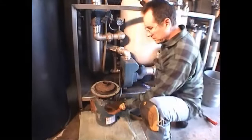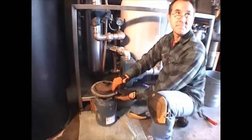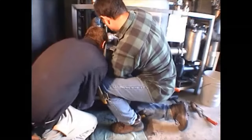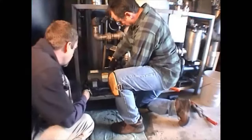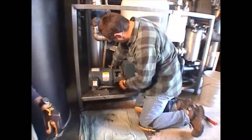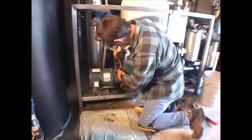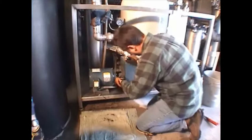Now you're ready to bolt the motor back onto the volute. I like to use a starter bolt with a little bit of anti-seize. It's good to have a friend because these pumps are kind of heavy. Put the pump and motor back onto the standoffs, line everything up, and carefully slide the impeller back into the wear ring — make sure your bolt holes line up. When putting the bolts in, clean each bolt, add a little anti-seize, and tighten in an opposite pattern: do one bolt on one side, then go to the other side and do the next bolt, all the way around until snug.